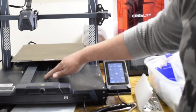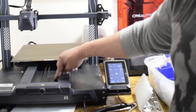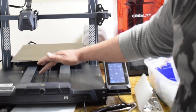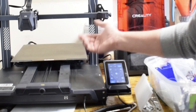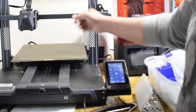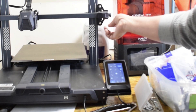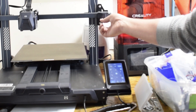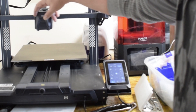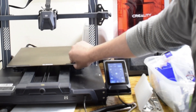As far as the belts, mine's not really that loose or tight. But if you let it go really loose, that'd be bad — it's going to be slipping on the gears. I try to get it so my thumb just barely drags over it. I'll give it a little bit more, a quarter of a turn. Same with the gantry — I just kind of drag my finger across it going righty-tighty. Now it stops immediately when I drag across it. Touch the belt and give it about a quarter turn more. As long as the gears aren't slipping and the head isn't slipping on the belt, you're good. Same with the bed.